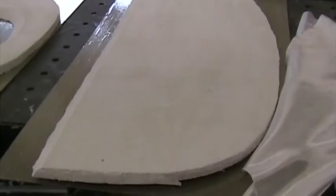This is the bulkhead that was made previously, the one at the rear edge of the steel undercarriage channel, and as you can see, it contacts the bottom of the seat module and has to be trimmed until a good fit is found between it and the seat module. In the tail dragger Whisper, this bulkhead will not be used at all.